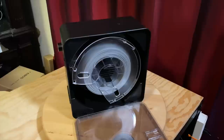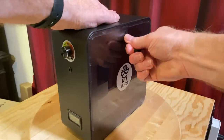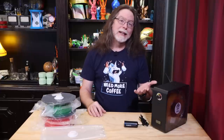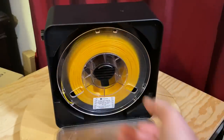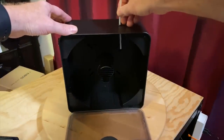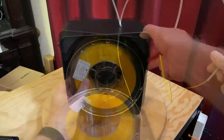The EaseDry fits most spools comfortably, and you can use it to keep filament dry while you're printing because it has three filament exit paths — one on the front, one on the top, and one at the back of the unit. The spools are supported from the hub, not from the rim. I find this pretty handy because I have a few spools with damaged rims, and I can't do the print-while-drying thing with the Sunlue dryers. Loading filament in the EaseDry is easy: pull down the release cord on the side cover to unlatch it, and then keep pulling away from the unit to pull the cover off. If you're intending to print with the filament while drying it, iBoss includes a fairly long piece of PTFE tubing — poke it through one of the grommets at the filament exit points and load the filament into the tubing before putting the filament inside the unit.